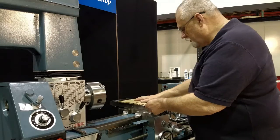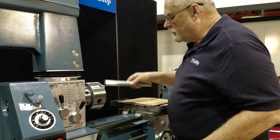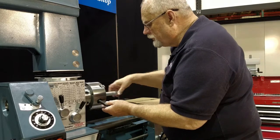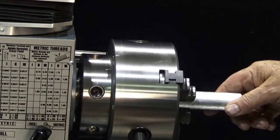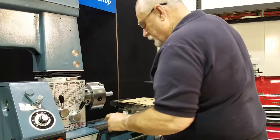To remove our chuck, I'm going to put a piece of cardboard here on the table so I've got a place to set the chuck. I'll take a little piece of round stock — a broomstick, this is a little piece of aluminum — something to grab hold of so the chuck doesn't drop and fall down and damage your machine.